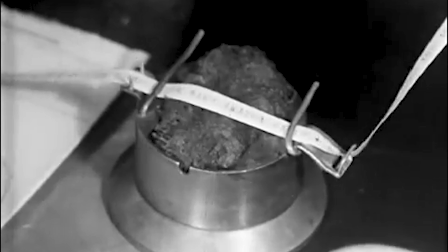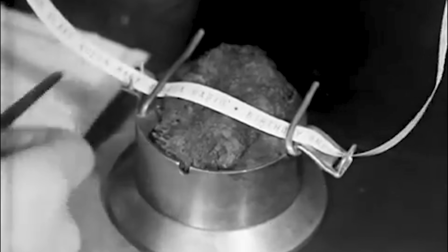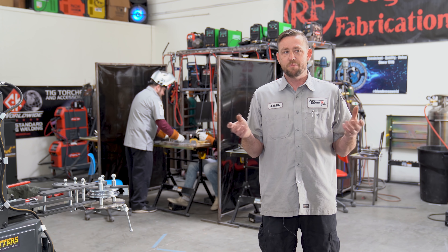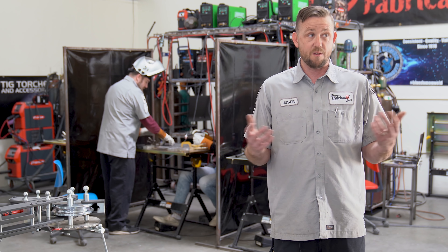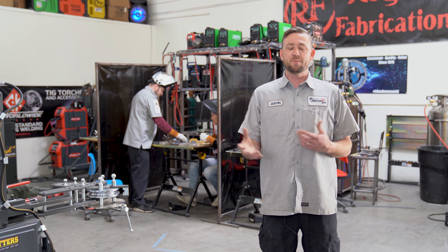The first thing you want to do is lay down your control weld at the start of every single session. Just lay down whatever it is that you got — we're not trying to be fancy, none of that — just lay down whatever you've got at the beginning of that session. Each weld that you lay down after your control weld will reference back to that control weld, until you make one that's better than the control weld.